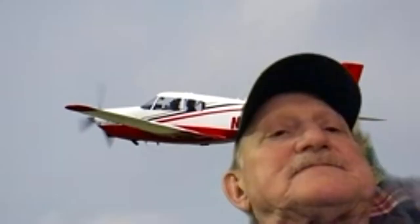Now, if you do have to go with a new blade, there is a chance that your shop will have to do a little rework on it to mate it in with the other two blades. Yes, both for balance and also for aerodynamic consideration, getting those dimensions tightened up so that they're all within a certain parameter as far as width and thickness. But yeah, 3/16 to a quarter of an inch, that's pretty significant. It is.